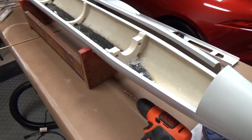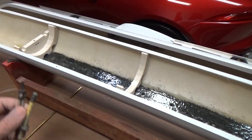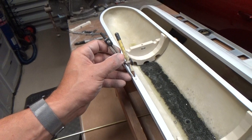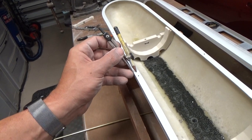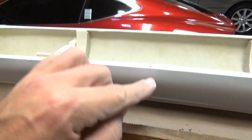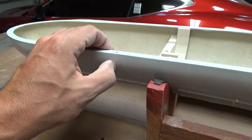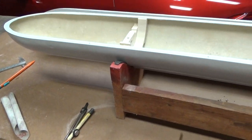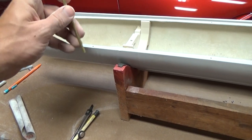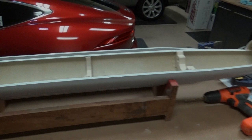What I have decided to do now is put in some alignment pins that will keep the upper and lower hulls aligned both side to side and forward and back. I've ensured alignment by using a compass set to a uniform width and marking out the holes, choosing to align them to these panel lines so that the upper and lower hull holes will perfectly align once these pins are drilled. I'm going to use 3/16th-inch brass rod for this — cut off about an inch, insert it in there, round off the tip, and then when the upper hull is dropped on top it'll go into the hole and hold everything in alignment.